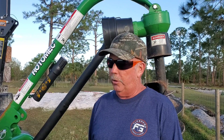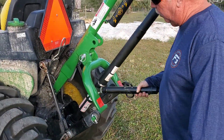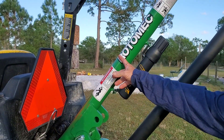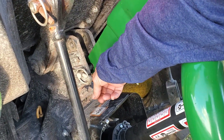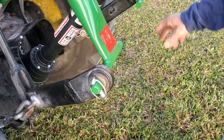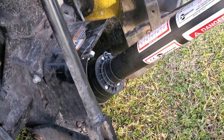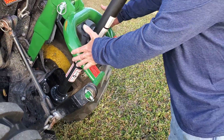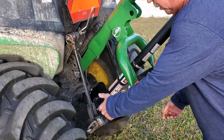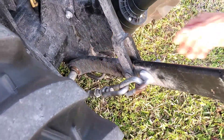First, it's not iMatch compatible, so you're going to have to take your iMatch off. Second, you're going to have to take off this adjustable bar that usually hooks up your equipment — it's got to come off because this digger hooks up right here with one big pin and a safety pin. The other two points hook up your three-point hitch here and here. You'll need to adjust the linkages in or out an inch or two by spinning them, so the arms go in or out to fit just right.